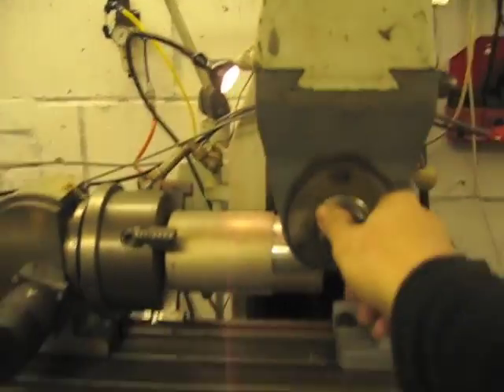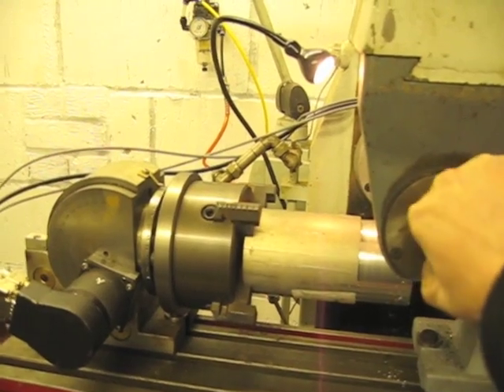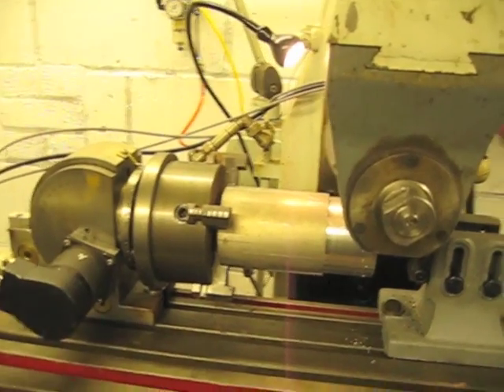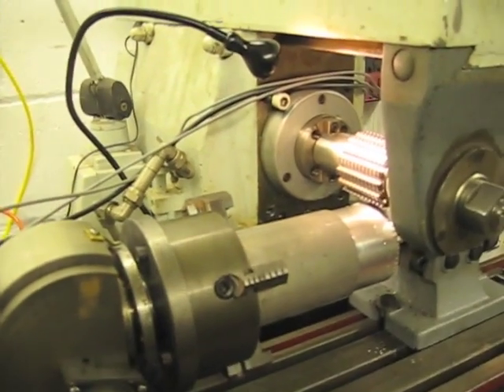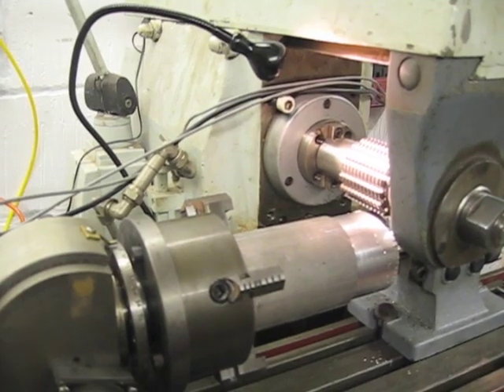So, as I rotate this spindle here, I see the other spindle goes at the same rate at one-fifth the speed — and that would make me a five-tooth gear. I'm not going to make a five-tooth gear; I'm going to make a forty-nine tooth gear. But at forty-nine teeth you can barely see the workpiece moving.